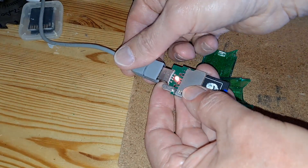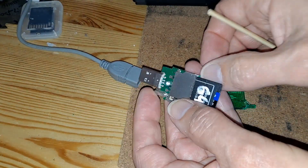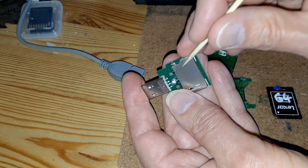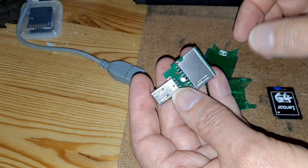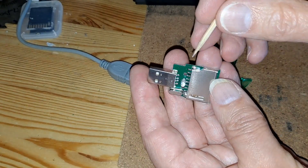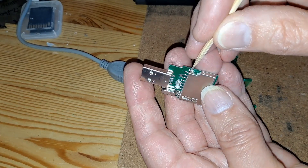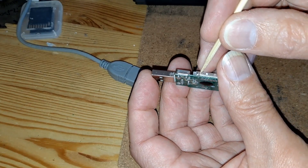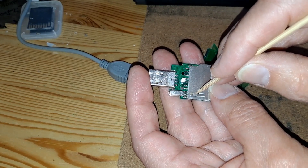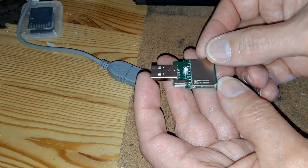What the problem was — if I just pull that out again — was this metal plate comes off. It's got little plastic tags on either side that hold it in place. And so if I wobbled that a little bit, then the signal would break down, or the connection. I eventually spotted that there should have been a solder connection in the corner. That makes contact down through there — there's a little brass contact there. And once I put a bit of solder on there, it's all working again.